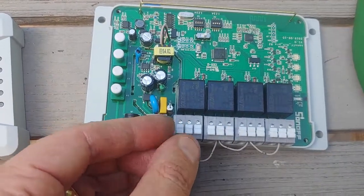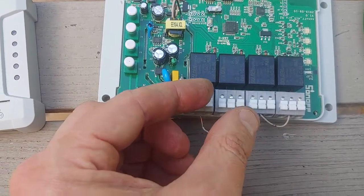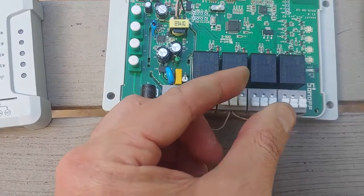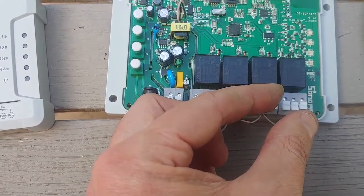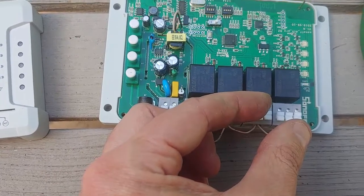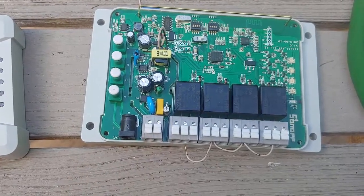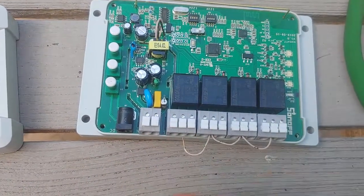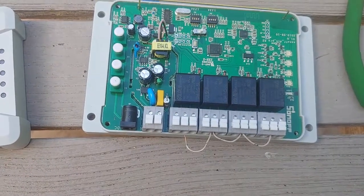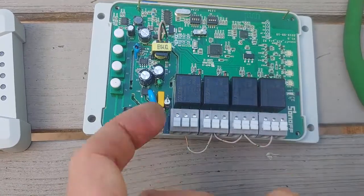So you say something like 'Alexa, spa on' — it does that momentary close. 'Alexa, pool on' — it does that. 'Alexa, heater on' — it does that. And I'm going to use my fourth one for heater boost, which will turn my system on for several more minutes so you can boost the heat. You can program those to anything you want in your Hayward, Jandy, or Pentair for the spa side remote. That's where you program over there what's going to show up over here.